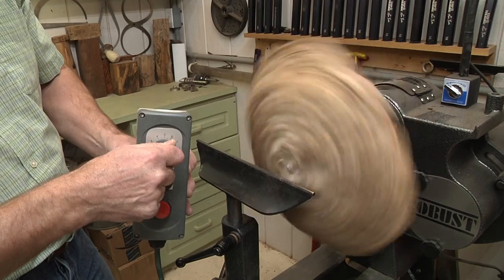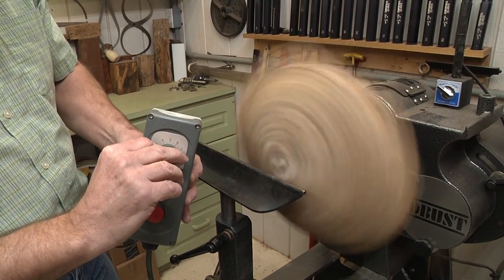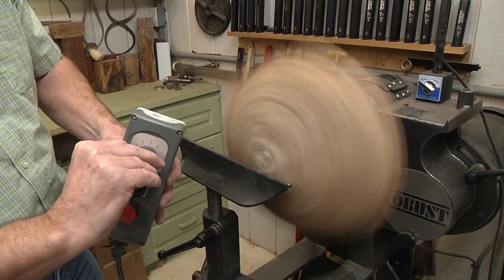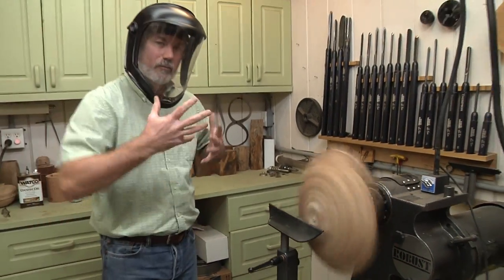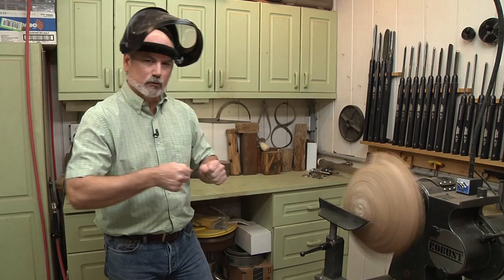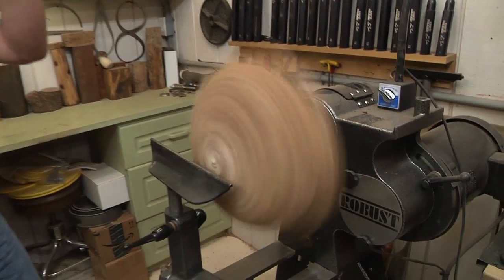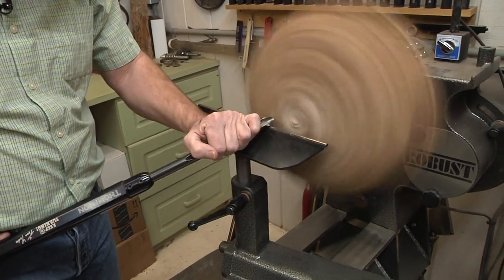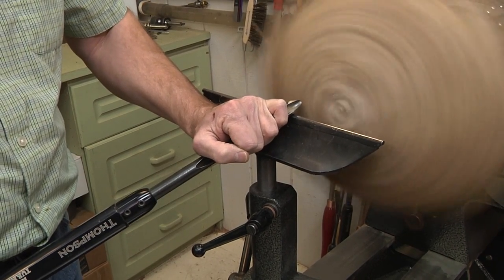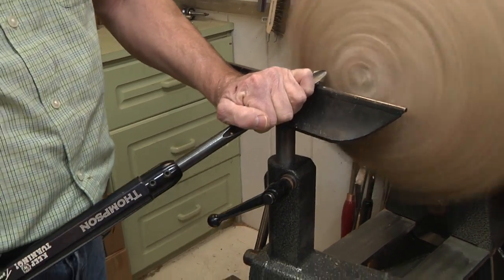I'm going to pick up the speed and you're going to see and hear the vibration. You can find a little sweet spot just past the first vibration. So we're going to turn with this. The idea is when you're turning something that has so many voids and so much air, you want as much speed as possible because you don't want the tool dropping into the hollows. So I'm going to bring the tool in and just kind of go — hear a tick? Feel the bounce — it's going to take a little while before I get to where I have solid wood and get rid of that bounce.